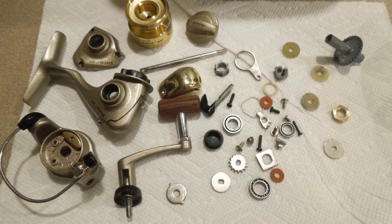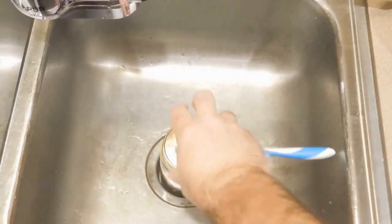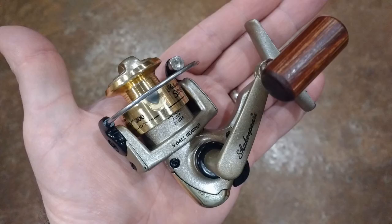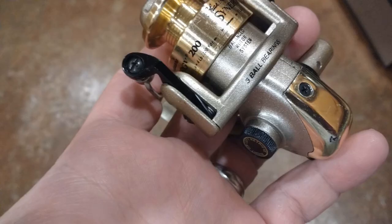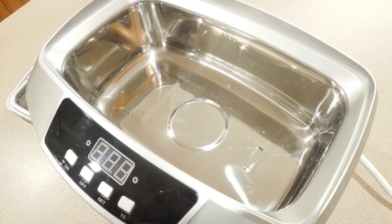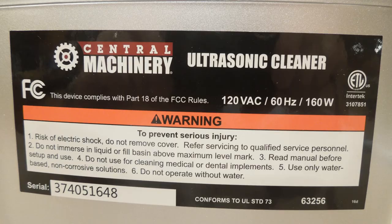For the bearings, after they run through a cleaning cycle I'll drop them in acetone and run those through the parts cleaner to make sure all the old grease is out. I also had to use naphtha and a toothbrush on the pinion gear because it didn't come completely clean. That's all I've got — I think these parts cleaners do a good job. The tips about using a separate container and the little infuser for small parts should be useful to you. Take care and tight lines!